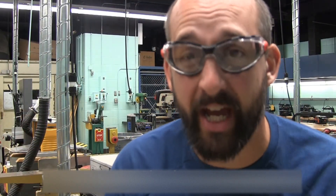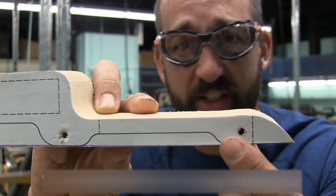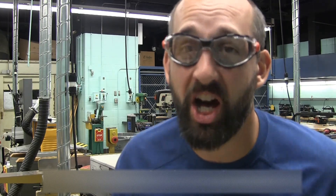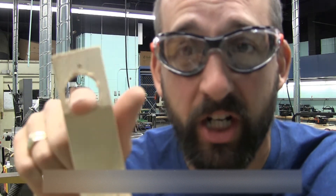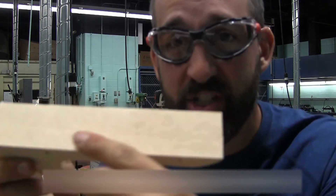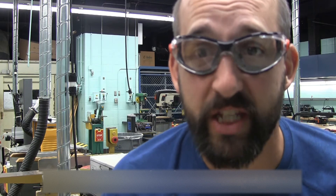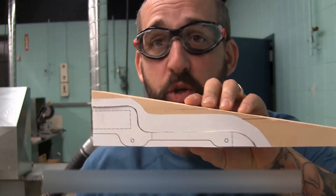So the next thing is decision time. The question you're going to ask yourself is: do you keep cutting? If you look at this design, there's still more that's going to get cut out — there's this entire section down here and then a section back there. Most of you are going to say yes, I should continue cutting, unless you're drilling a hole through your car. My advice: leave the bottom of this car flat until you've drilled that hole. If you're going to do that, look at the end of this video — I'm going to have a link that shows you how to drill these parts of your CO2 car. But if you're not, and you're like me, you're going to do something different with your top view, then it's time to cut these other pieces out.